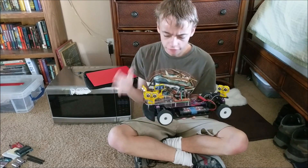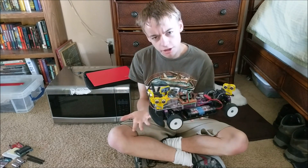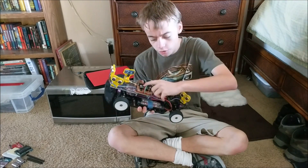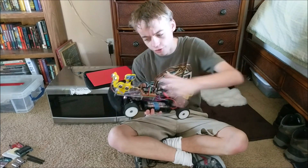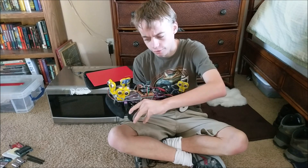As part of their competition they have to build a car that does this. And because none of the people on the team actually knew how to build something like this, they called on me to help build it for them. So what I did is I built this RC car, or modified it, with an Arduino circuit board, so that way it can use the inputs from these four distance sensors to control the output to the electronic speed controller and the steering servo.